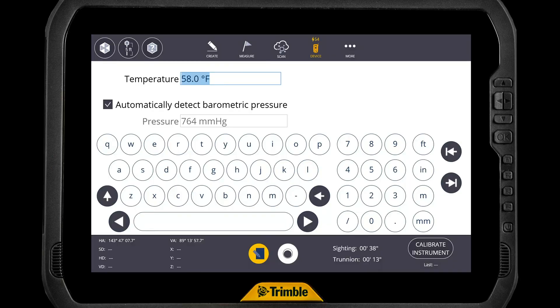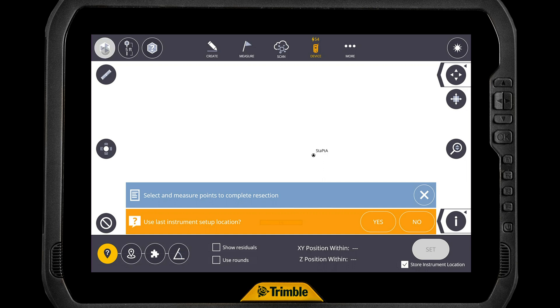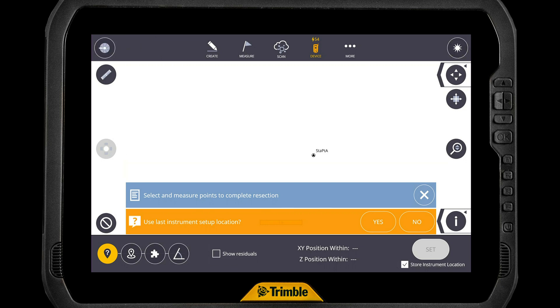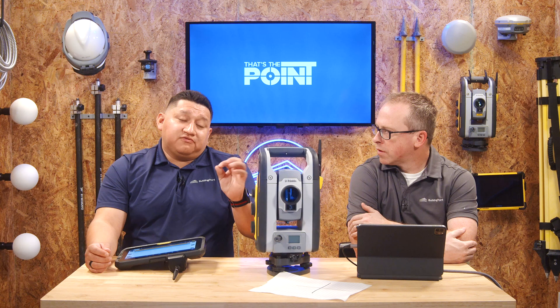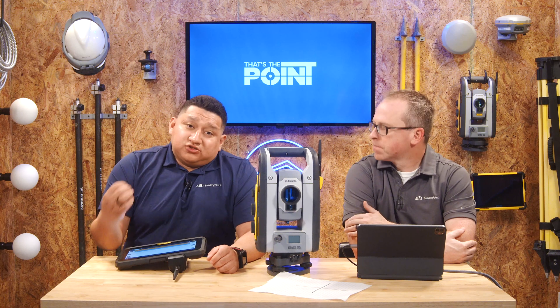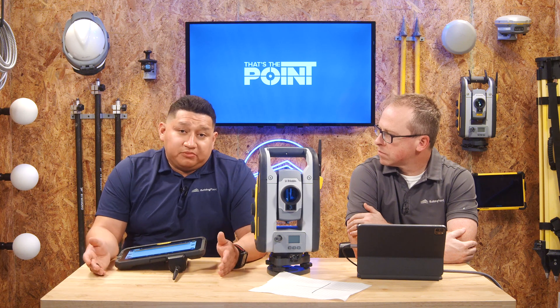Go back within Field Link, press Device Setup, and press the prism icon to switch it into laser mode. Then look through the scope and see how the laser lines up to the target on the crosshair — or the mark that you made. If you can't physically see it because of lighting conditions, walk up to the target and physically check that the light being emitted from the instrument is hitting dead on. If it is off within an eighth of an inch around the center of that target, you will be able to correct or compensate for it with your HAVA collimation. If it's anything more than that, you are going to have to bring it into your local service dealer.